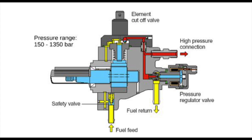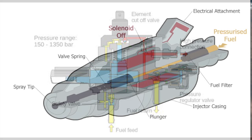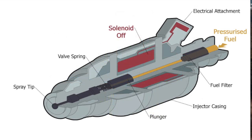As technology advances, we're now seeing more common rail diesels used as marine diesel engines. The pump on these diesels has just one single outlet going to a common rail. The injectors on this type of engine are energized by a solenoid, being told to fire by the engine's ECU — so it's electronic control of the pressure out of the nozzle, but the principle is the same. This computer control of the injection point has distinct advantages in that the injection point can be advanced or retarded as the engine speeds up or slows down. However, electronics and salt water don't always mix well.